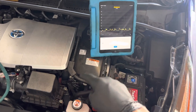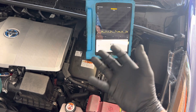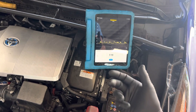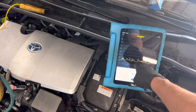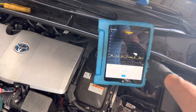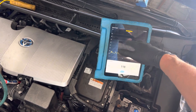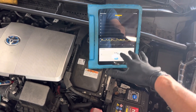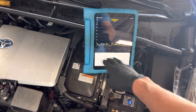So if you keep watching your pan of frying oil as it bubbles and boils, you'll notice more and more bubbles come out as the temperature gets higher relative to sea level pressure or wherever you're at. Well, the same thing here — as you boil out more moisture from the oil, the pressure can no longer go higher. It starts going lower, and as the pressure goes lower, it takes you into the next level where you can remove even more moisture. Then there comes a time where it flatlines.